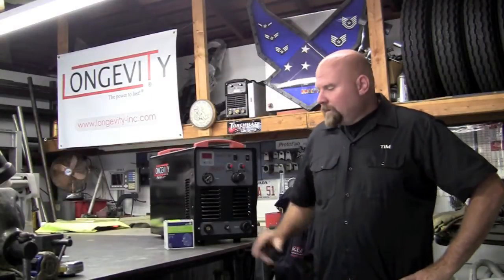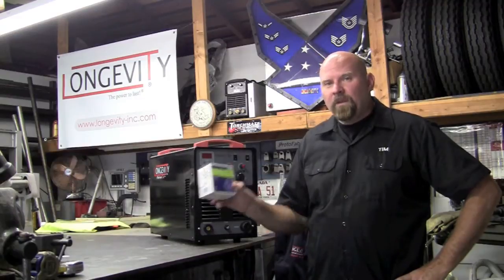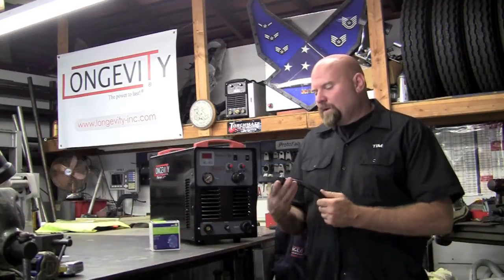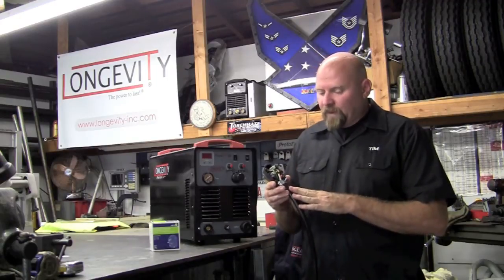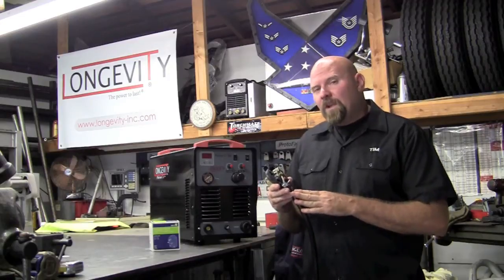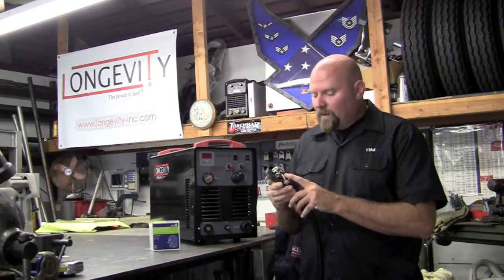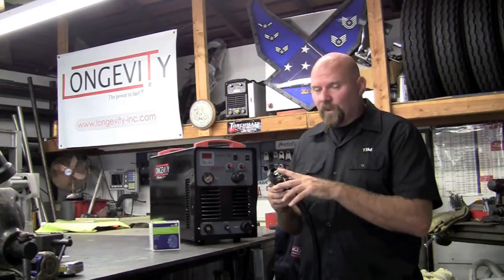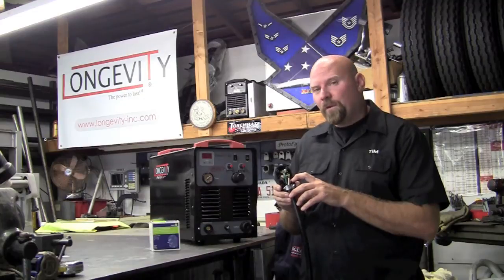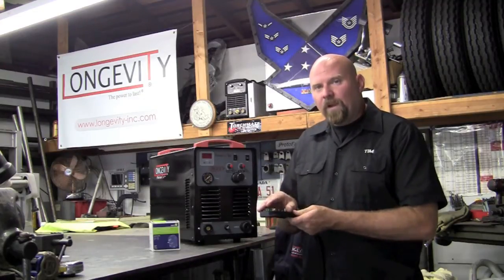For wiring in my ADI, I made another trip down to Home Depot and bought the Leviton plug that's compatible with my shop. This machine is set up for dual phase — it can be single phase or three phase. If you're setting it up for single phase, you'll use the black as L1, the white as L2, and green as ground. You'll simply clip the red, which would be your third leg if you were using three phase. Put the plug together and you're good to go.